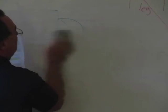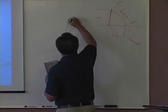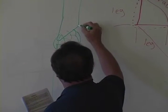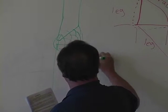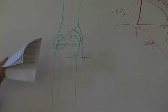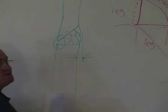When it comes to groove welds, it's no longer called convexity — it's called weld reinforcement. A small amount of weld reinforcement is desirable. As it states right here, no more than one eighth of an inch. So if you start seeing fat, ugly welds on your H-piles or pipe piles, you can put a piece of eighth-inch metal on each side and run a straight edge across. If that straight edge touches, he's got too much.